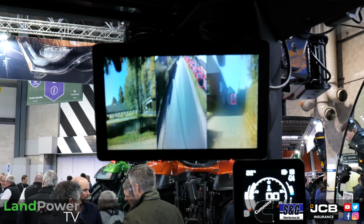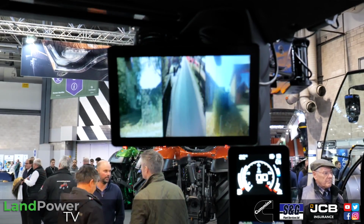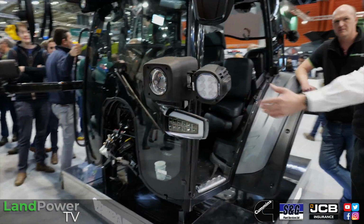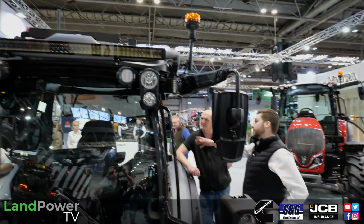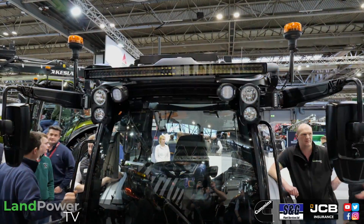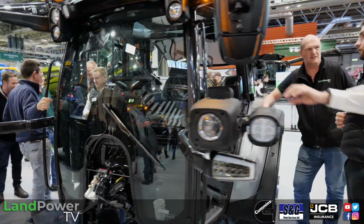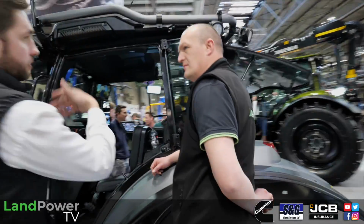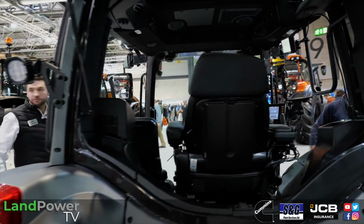The SmartAg team that works for AGCO develop gadgets effectively that can be added to existing and new product. So you have cameras on the front of your tractor or implement, such as on the front of your mowers or weight block, looking left and right, and then one on the back of the tractor or trailer. When you come to a junction, the software within the system will identify any hazards. It'll put a red box around, say, somebody on a bike or a car or a horse, and you can then adjust the sensitivity so it can beep at you or just purely put a box around. A really good safety feature, especially when you've got implements that stick far out in front of the tractor.